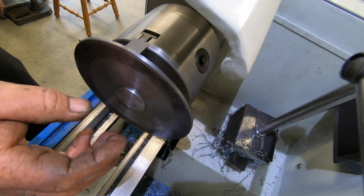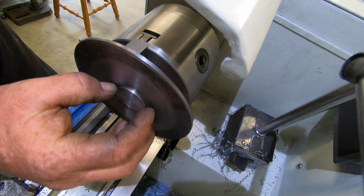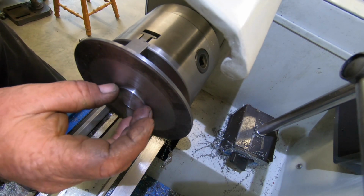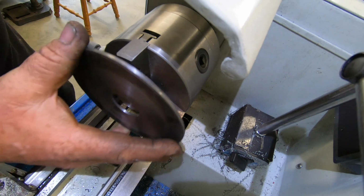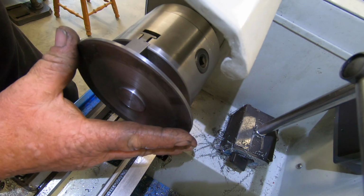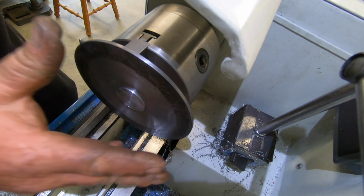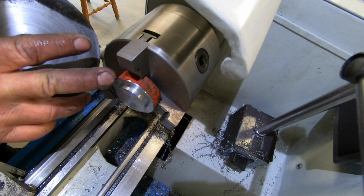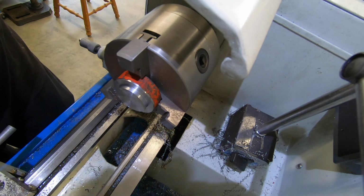That'll do that part. When I make the outer boss up, it will be just a little bit larger than that diameter here, and it'll just nicely snug up firmly over that register. And I will put a very small dowel in there so it will lock into place. There's no chance of it spinning halfway through a job, which probably never happened, but might as well over-spec it than under-spec it, I suppose. Anyway, I'll just break the edges on this, and then I'll spin it around and clean up this back edge. Bring you back shortly.